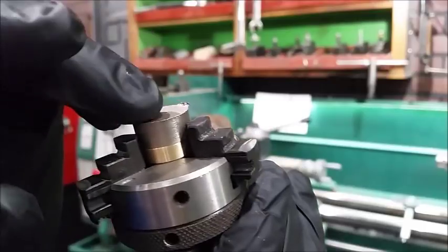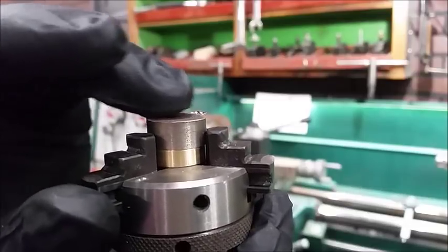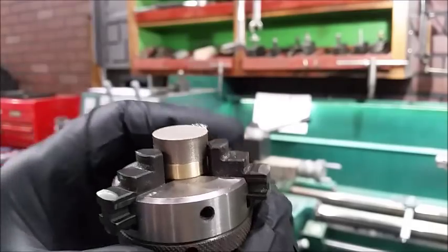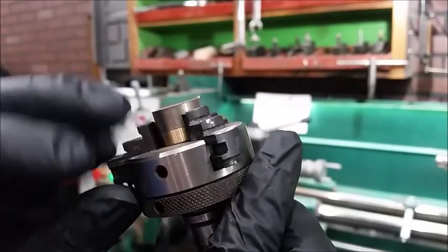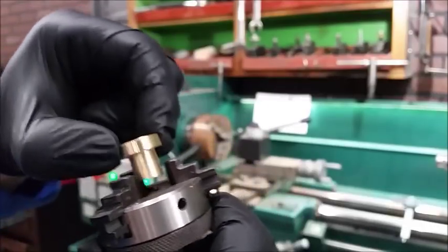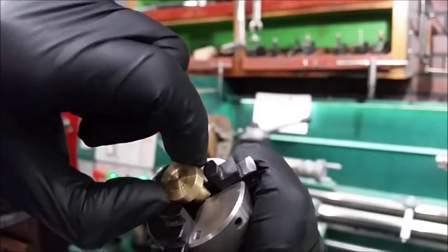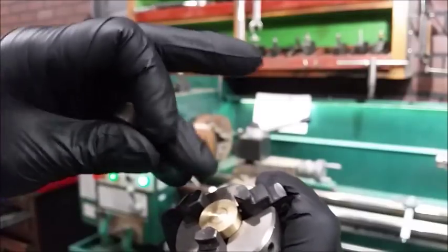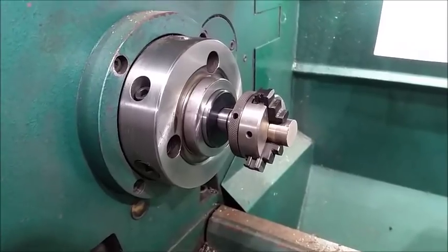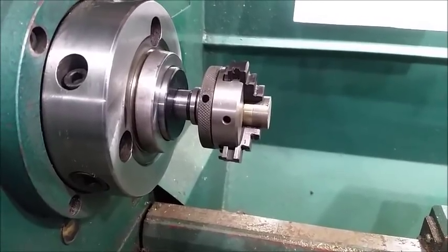I had to machine a special brass fitting to go in there to hold this piece, offset it so I can cut it down, with the tool on the lathe set precisely so every time I cut one of these it'll be set the same way. This goes inside the chuck — basically a plug. It's a two-inch chuck, which is real small, but I don't have collets, which would probably work really well for this. The chuck is mounted and ready to turn this down to 0.250 inches.